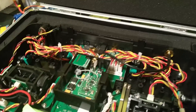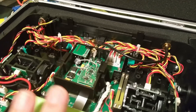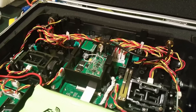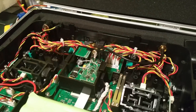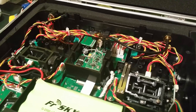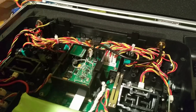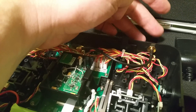I prefer option number one. If I have 10 receivers for this module, I will bind them all at one time and just cover the radio. I will not prefer making any holes in the Taranis E that are not necessary. So I will fix the module, put it in the right position, fix it with hot glue, and install the antenna connector on the module and the antenna here.